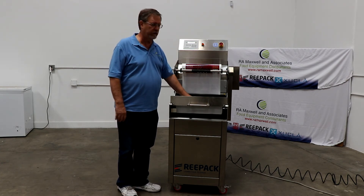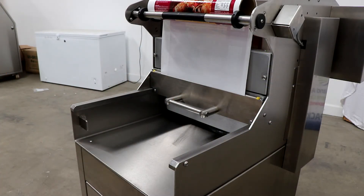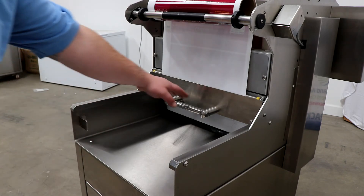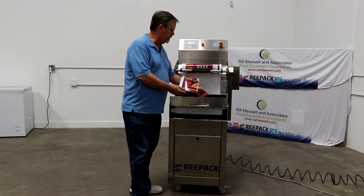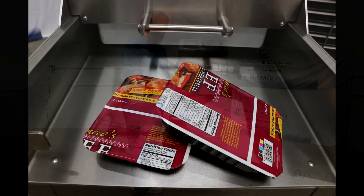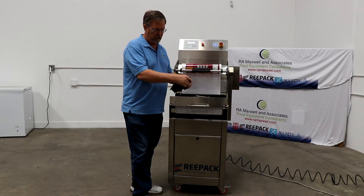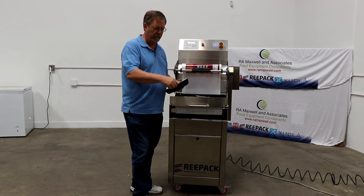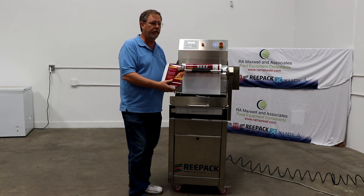We have our food in our trays, and now we're just going to push our tray in. The film is starting to advance, we're going into our time — and it's done. There's our beautiful product. You can see this is what they call a profile cut, so the cut goes right around the profile of the tray. And this is an optional pull tab — I always recommend this; it makes it very easy for the customer to pull it back. Beautiful packaging, very simple.